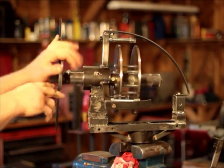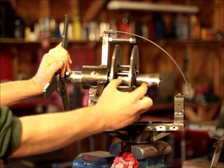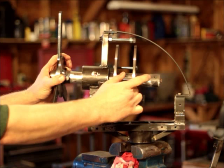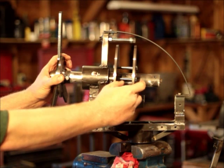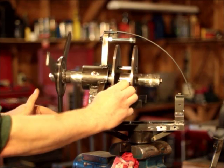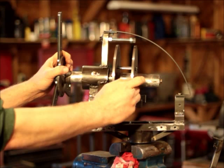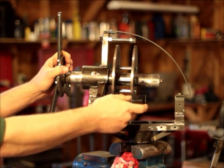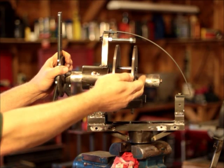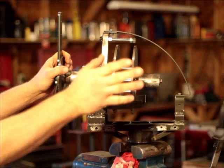I really like this design. I did make provision for a third magnet plate so you can have two stators. I think that's the exciting thing about having this straight shot wind turbine, where it just goes right into the wind. You're going to have two stators that produce power and go into either a battery bank or a grid tie. My theory is the first one is for low winds — startup through perhaps 25 to 30 miles per hour. The second stator, once I add it, is going to be for the brake — but not just a brake. It's going to feed into a larger grid tie so both stators are running, rather than just heating a resistor or furling out.